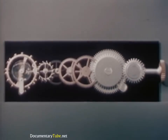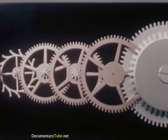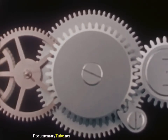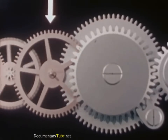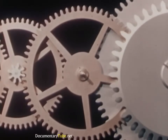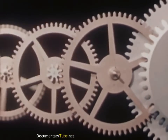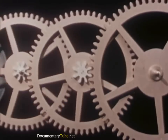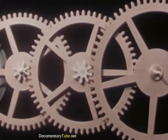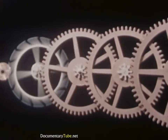We'll stretch them out in a line instead of in their usual closely confined location in a watch. Look at the gears a moment and see what they do. First, a small partial turning of the mainspring barrel drives the center wheel a complete revolution. A partial revolution of the center wheel drives the third wheel a complete revolution. And this in turn drives the fourth wheel much further. As a result, a few turns of the mainspring barrel driven by the mainspring will drive the escape wheel many, many revolutions, enough to last a full day and longer.